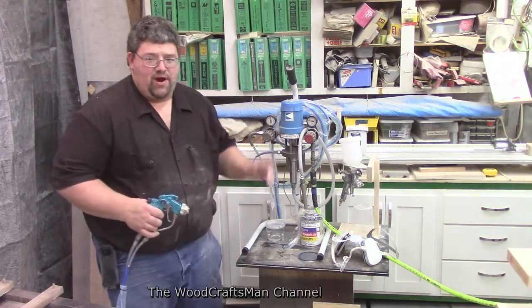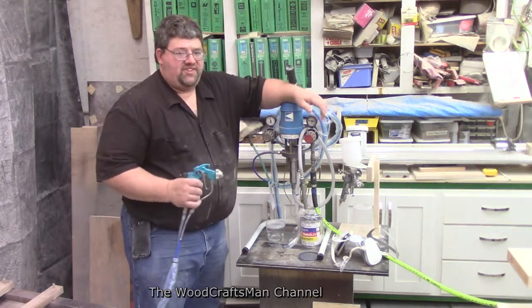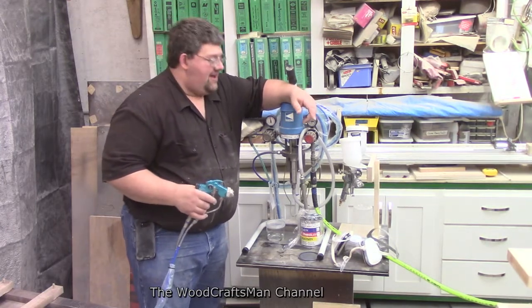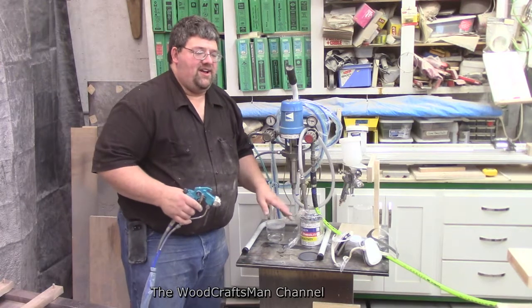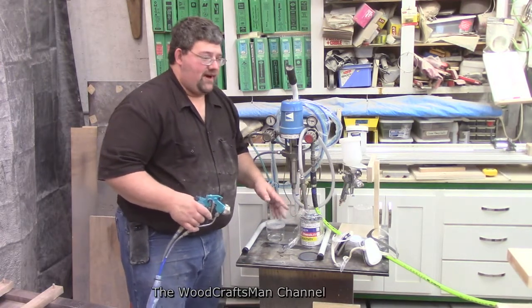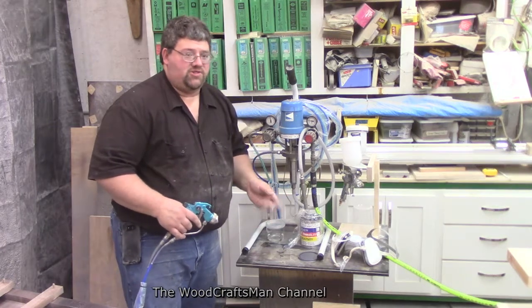I just got done spraying and sanding the pre-seal, and I have two doors that got a pre-seal and two that did not. The pre-seal is nothing more than a 9-to-1 ratio of the Hydro Plus waterborne top coat, cut back nine parts with water.